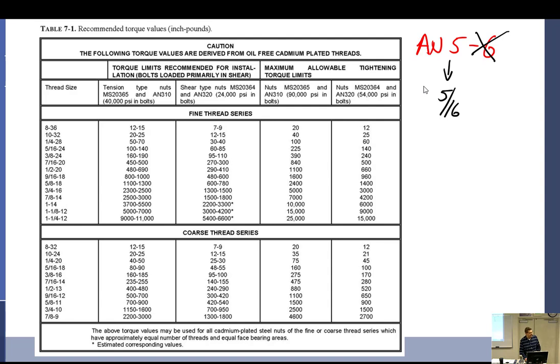So I have a bolt and I've determined it's five-sixteenths diameter. How do I measure it? By the diameter — with a dial caliper. So I'm going to come to the chart and look. It's going to be either fine or coarse thread. Chances are it's going to be fine, especially if it's an AN bolt — AN bolts are fine. So I need to figure out the threads per inch, TPI. I have two choices: 24 or 18.